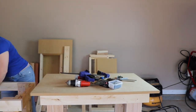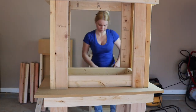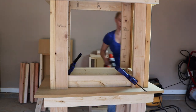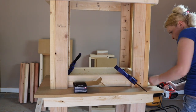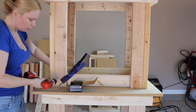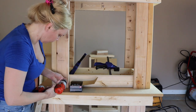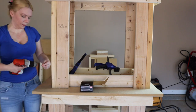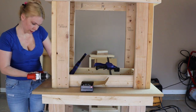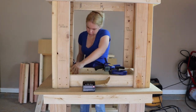Now for attaching the bottom frame — I just flipped my table over and set it up on the other table so that I can get a really good grip and work that frame in between the legs. You can see why it needed to be one and a half inches on all four sides, because we need it to fit on the inside of the legs. It's probably going to be a little tight squeezing it in, but just maneuver it in, knock it in, tap it in, and then insert your wood screws through your frame. I did this in the middle of summer so it was very hot and I was dripping buckets of sweat.